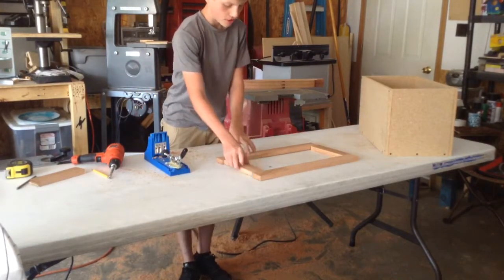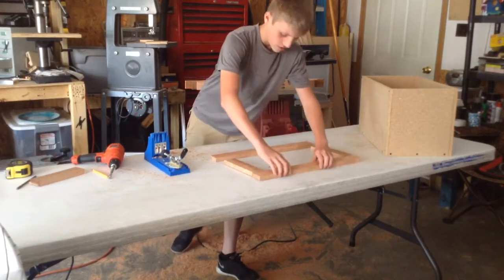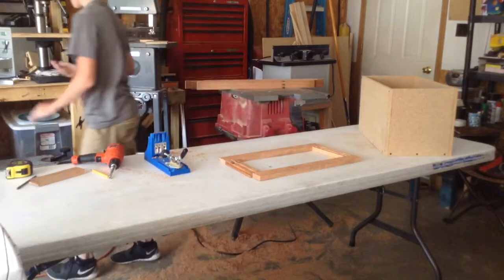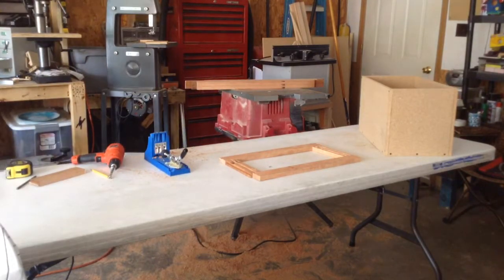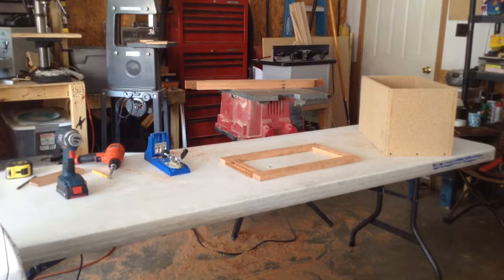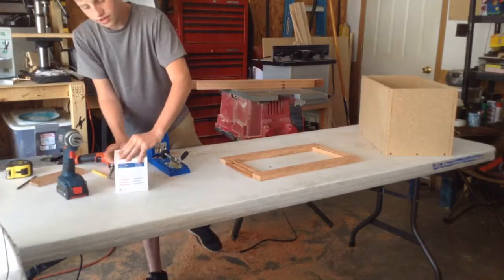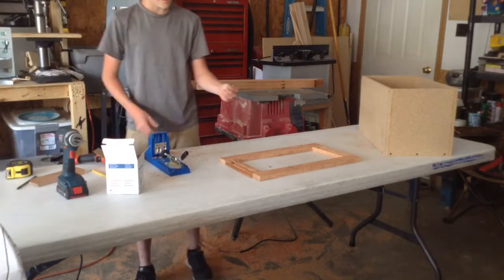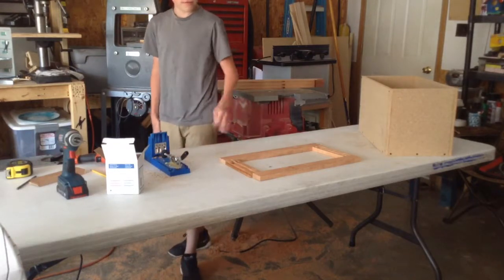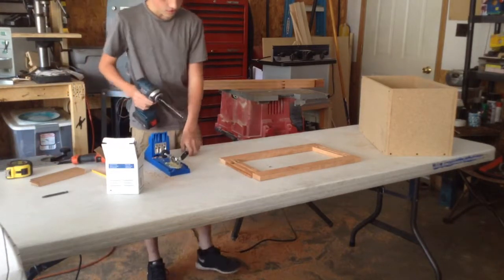So I have those already drilled. I'm going to flip this over, making sure the grooves are right — see how they all go together like this. Grab my driver. It's three-quarters so it takes inch-and-a-quarter screws. Last time I was at Lowe's I bought a whole box of 500 of them — kind of expensive, 20 bucks. One thing I kind of messed up is I got fine thread, which is okay. It usually works, especially since I'm going to be using this hardwood flooring — it's hardwood so it's fine.